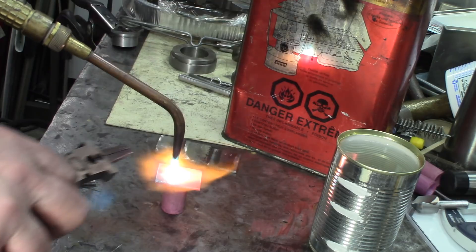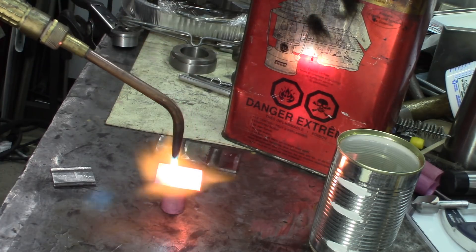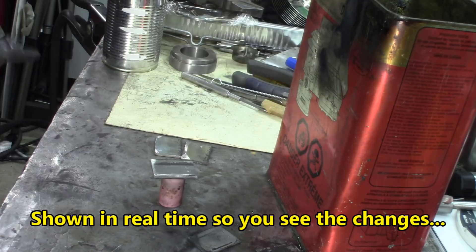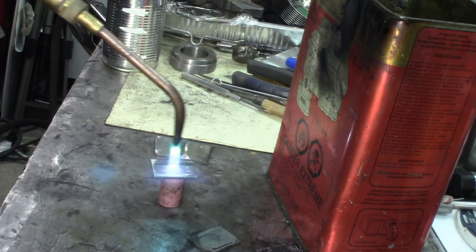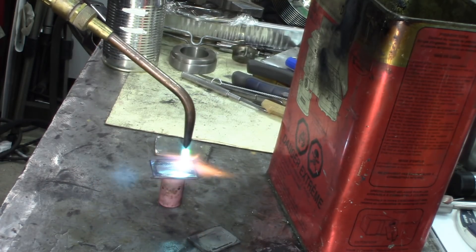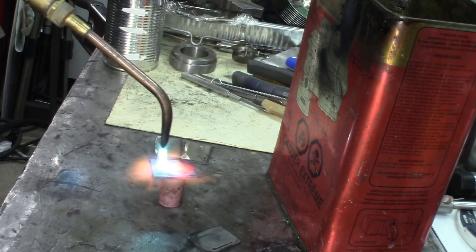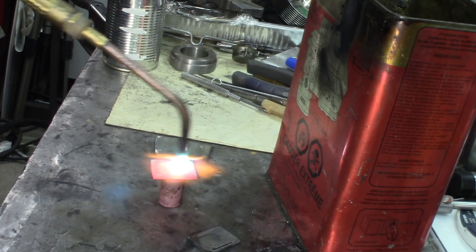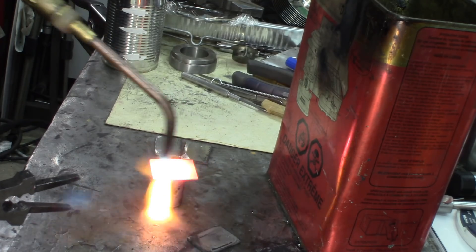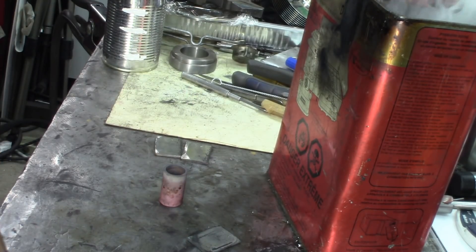You may notice that the hottest part of the flame is right at the end of the tip. We don't want to be so far away, just close enough. Oil stuff now — same thing. There's a more precise way to do the heating for the hardening part: it's an oven. But I'm doing it like someone who uses bed frames would use a torch, so let's make it realistic for bed frame users. I'm visually appreciating the color here. Dunked in oil.